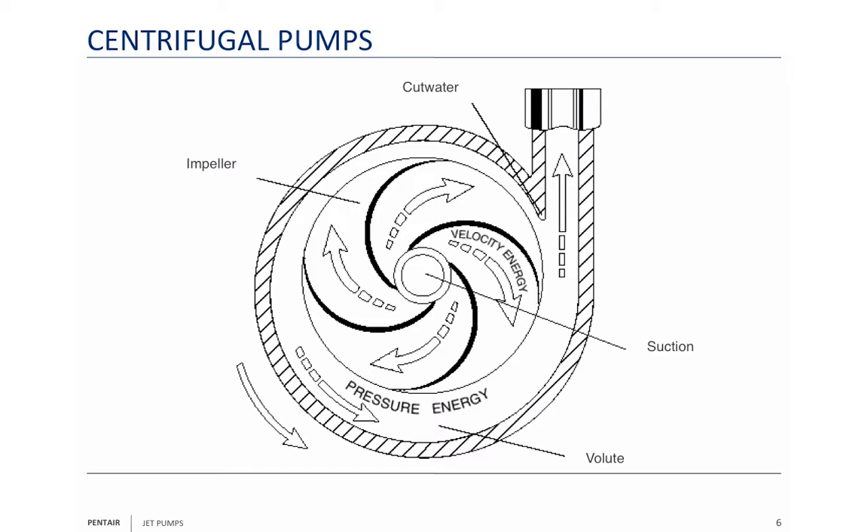If you look at our picture here, you're going to see that the centrifugal pump has a suction. We call that the eye of the impeller. The water is going to go in through that eye and then it's going to follow that vane around, and we're going to increase the velocity of the water so it will start moving faster. We'll catch that water in an area that expands, and as that area gets wider, that water is going to slow down and we're going to convert the velocity energy that we added to the water into pressure energy.